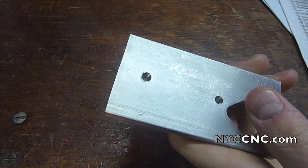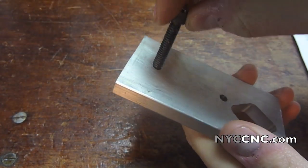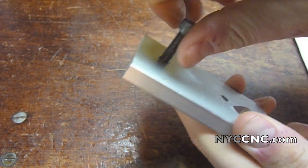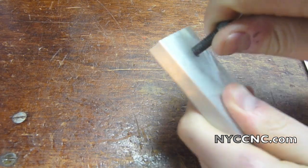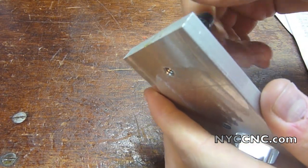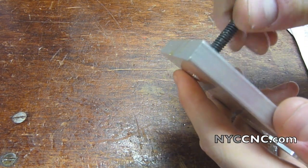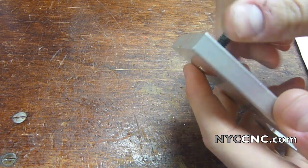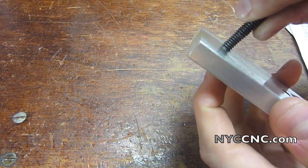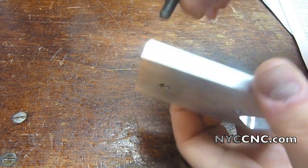Grab a 1/4-20 socket head cap screw. And that's a very, very nice fit. Very nice fit. And actually, it looks like I may not have tapped all the way through. Part of that has to do with the fact that I am sort of guessing on the correct tap depth of 0.6. I need to figure out the correct way to have the tap protrude through the right amount. Yeah. Oh, no. Barely wants to start back there. So that's the only little faux pas, but that's okay.